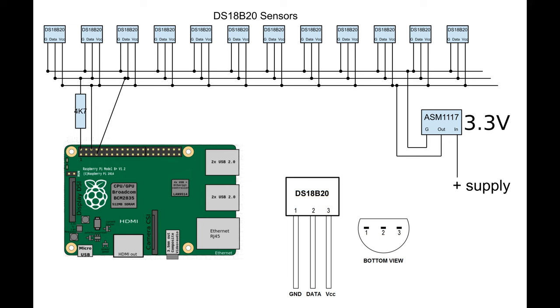It was only while I was looking into this further that I found the Raspberry Pi GPIO pins are not supposed to be pulled up to over 3.3 volts. So my scheme of pulling the data line up to 5 volts is not recommended, but that's not what killed the Pi pin. It was one of the failed DS18B20s pulling up the data line to over 7 volts. Another thing I was careless about is that the tab on the LM1117 that you solder to a heatsink is not connected to ground but to the output. I had not taken enough precautions to protect it from ground, and I fried another one while working out what was going wrong.